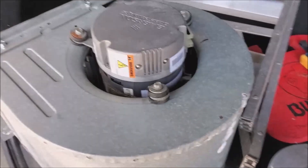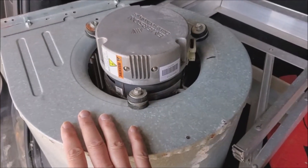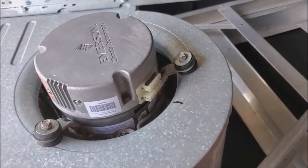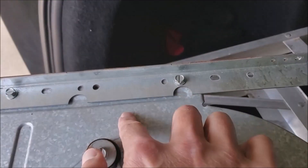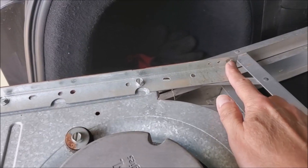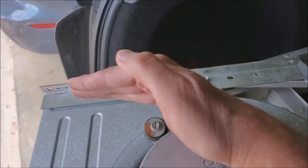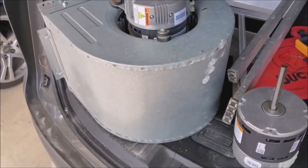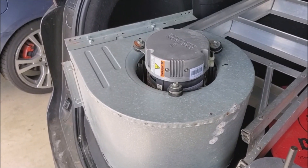This unit is from a Goodman system. The whole cage assembly is really easy to take out. You just take the front panel off and then you've got two connectors, cables that go up to the control board. There's a ground wire here and you remove those, then there's a couple of screws that tie this in. This thing just slides into the top of the air handler section — you take the screws out and slide the whole assembly out. I just brought it home so I can work on it and check everything out, then take it back and install it.